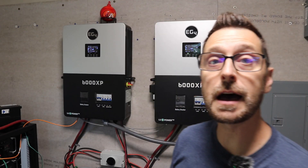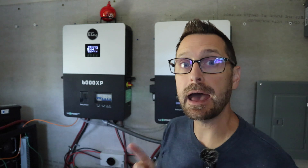There's one more thing in the home that might trip these inverters — the electric dryer. They had ramped back down to about 50%, so I kicked the dryer on. We hit about 120% load and the inverters tripped off — they could not handle all of that together. I don't have them set to automatically restart because I want to be able to see problems and troubleshoot without an automatic restart masking the issue.